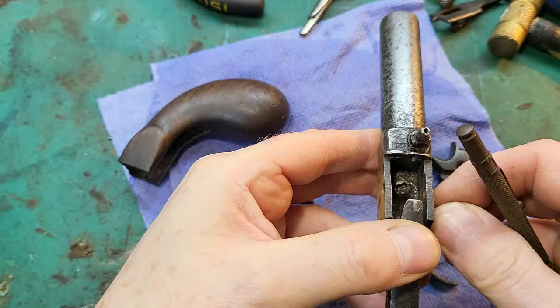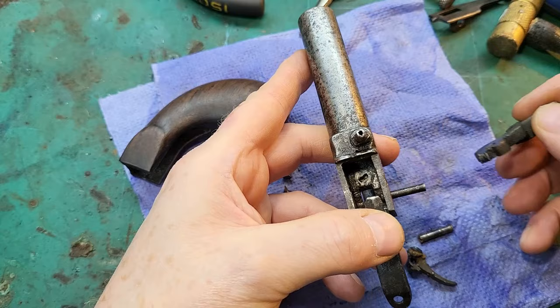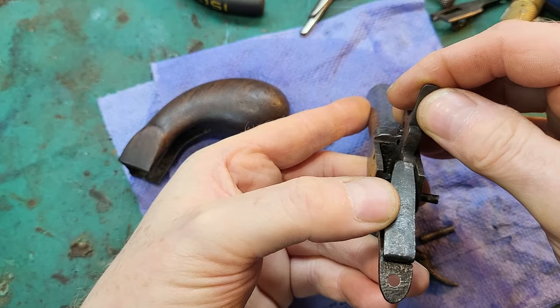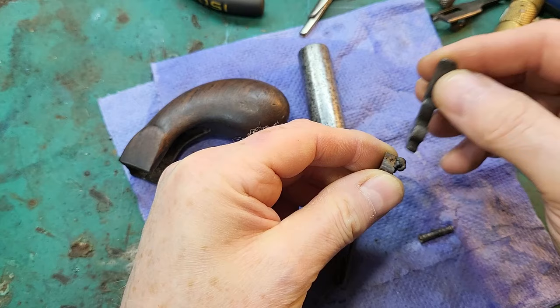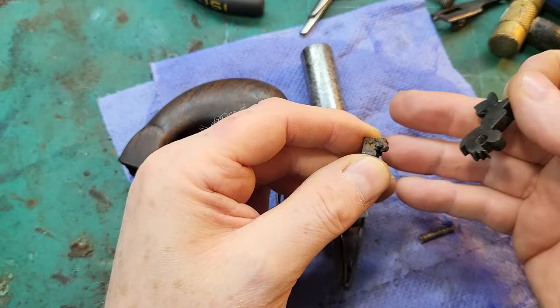If you notice there, there's a sight notch. So you're supposed to be able to look down the barrel and get a sight picture. Now, normally a percussion pistol would have the hammer just in the centre. No chance of aiming, so there's no point really in having a sight picture. But on this one, they've moved the hammer over to the side so that you can see down the barrel through the notch there. Now, that would be fine, except the trigger is still in the middle. And because the hammer's offset, it's riding the trigger there, so they've had to make it with an extra long bit of the trigger coming out, and it's, as I've shown you, just worn away. So I've put more weld on there